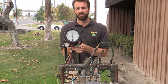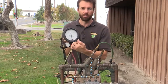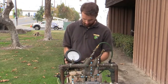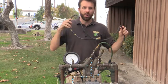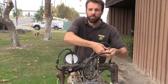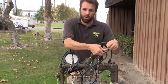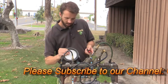So here's a troubleshooter. Now that we've identified that I'm putting high side pressure behind the first check valve to build zone pressure and I'm not getting the reading, that means I'm putting high pressure in and it's leaving. So there's a leaky number two shutoff valve with downstream demand. There's one thing we can do to try to fix that — go ahead and take our bypass. The bypass hooks from the number one test cock to the number four test cock. I'm going to force high side pressure to close my second check valve tightly.